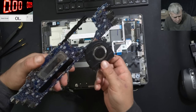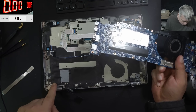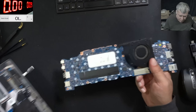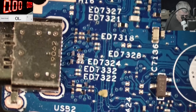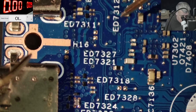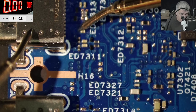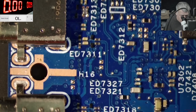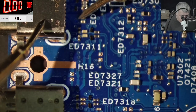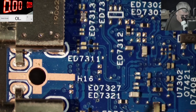The board is out. I can't spot anything visually — everything is looking fine. Let me grab the multimeter and check. On the main voltage pins coming onto the board, the faulty port is showing 8 ohms resistance. On the good port — check here — we have nothing, infinite resistance. So clearly we have a short: 8 ohms on that port.